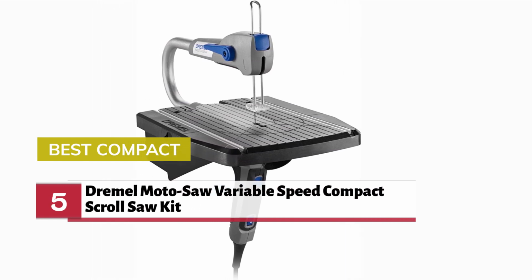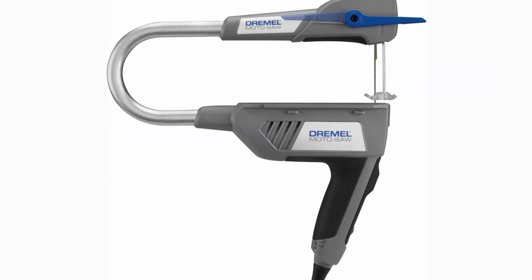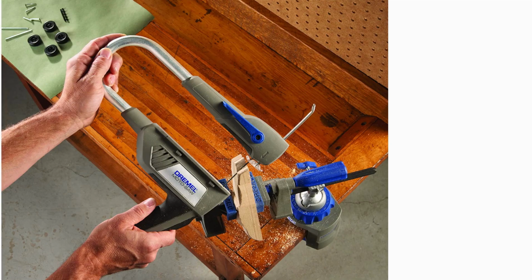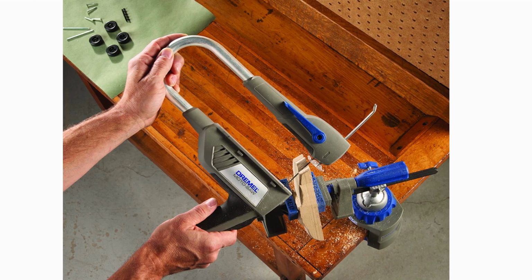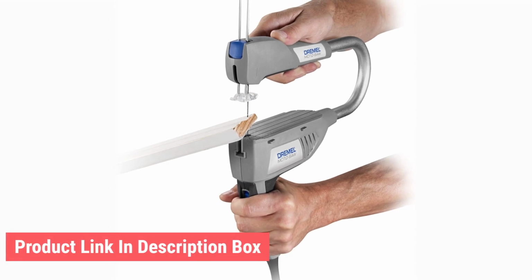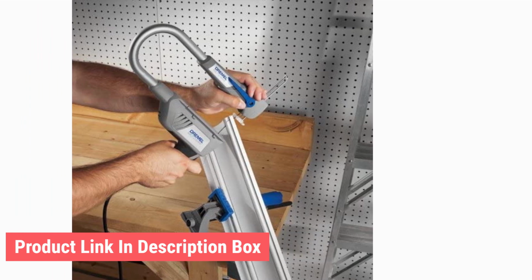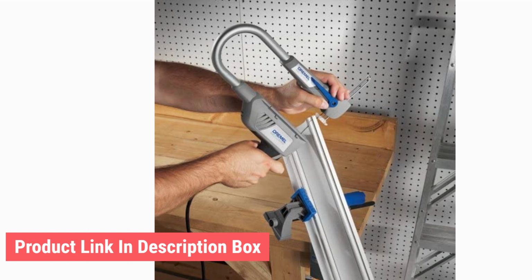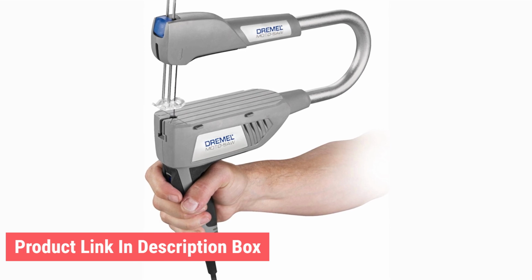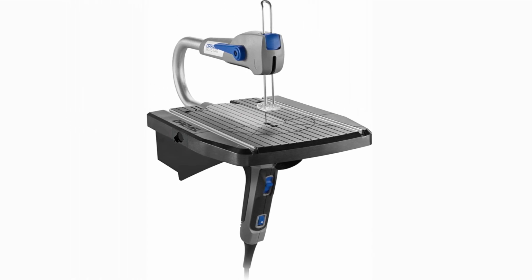Number 5. Best Compact. Dremel Motosaw Variable Speed Compact Scroll Saw Kit. Anyone who wants a little more from their scroll saw might want to give the Dremel Motosaw Variable Speed Compact Scroll Saw Kit a chance. This compact saw features a quick clamp base that attaches to tables and benches, allowing users to scroll like a traditional saw. However, should they need to cope a molding or scroll on a larger workpiece, this saw detaches for handheld use. This model features variable speed so the user can adjust according to the material they're cutting. It also features a system that automatically applies tension to the saw blade for quick blade changes. The base has a built-in dust collection port as well.